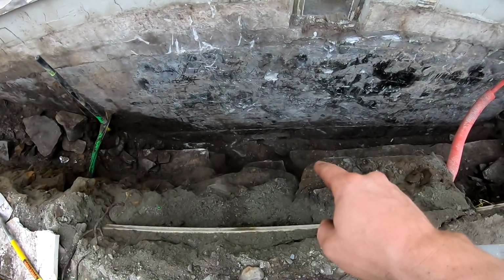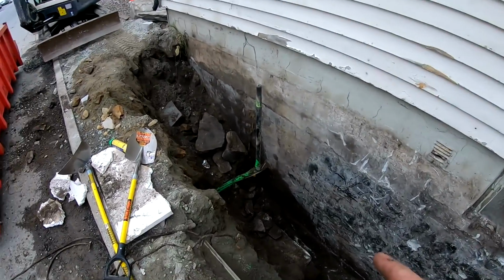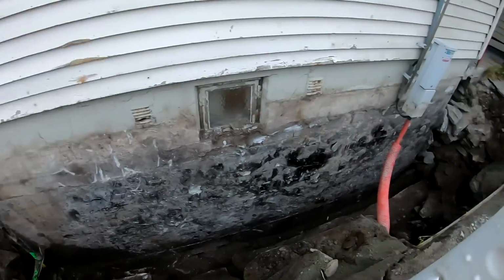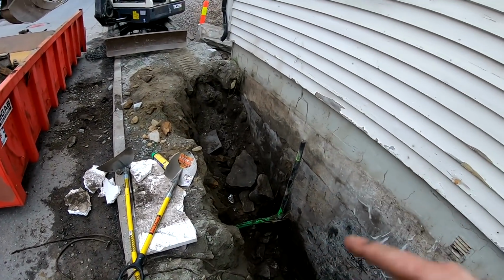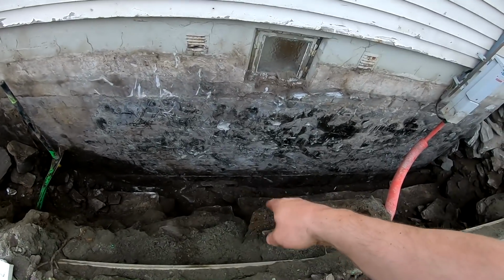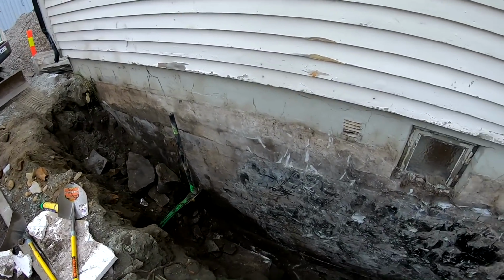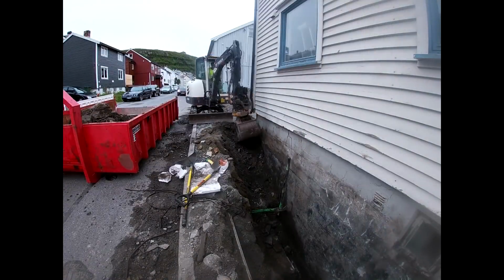I'm pretty sure down there is the sewer line, after what I could see inside also, but it could be under the water. Normally they go together, or it could go on the other side of the house and down to the street. But we are putting piping from there with level down there and around the house, because there is no room for connecting anything to the sewer down here, and everything down there is concreted together just like the wall they have built here. So this was a hell of a job, but let's just get the rest done. The rain is coming pretty soon.